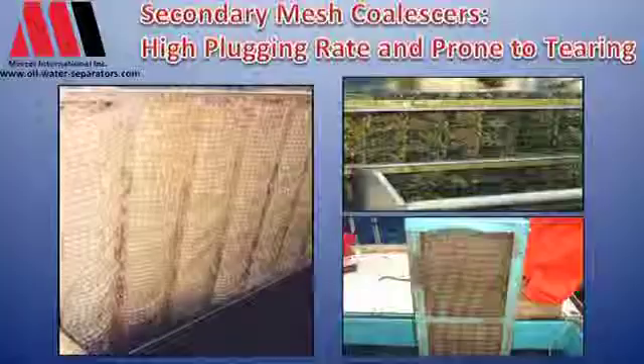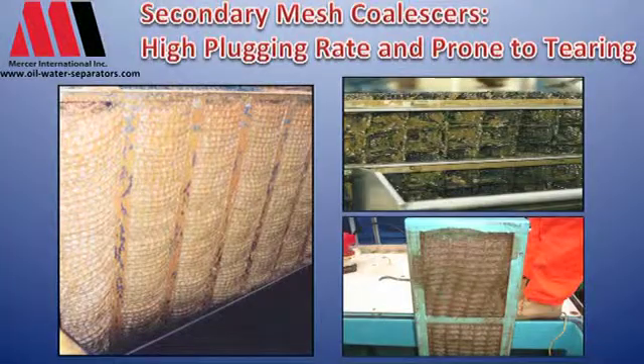This is a very difficult pack to clean. A traditional pack in industry is probably 8 inches, 12 inches, up to about 14 inches thick. Cleaning that deep into a pack like this doesn't work. The solids get hung up so badly that these packs tend to sag with the weight of solids — and it just becomes a removal cost.